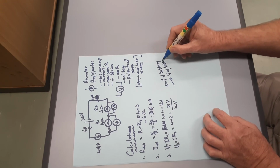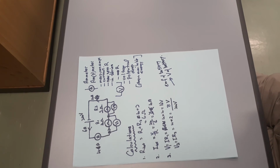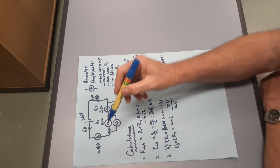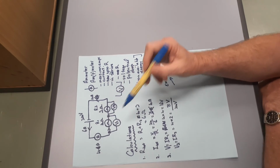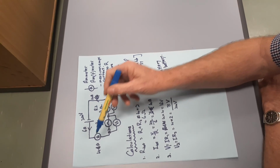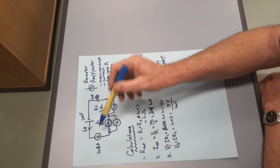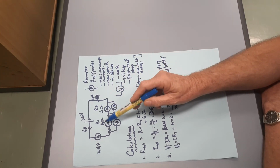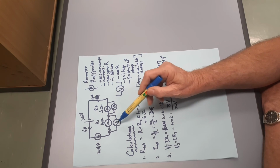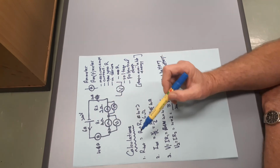There's a whole lot of language to learn here, and little by little, we're going to learn it. So, what's the lesson for today? Number 1, Alessandro Volta was shocked to discover electricity. Number 2, ammeters are connected in series. Number 3, voltmeters are connected in parallel. They have infinite, well, very, very big resistance compared to the resistance here. So this is 6 ohms. This might be 5,000 ohms. So it's huge compared to this and has very little impact on the circuit.